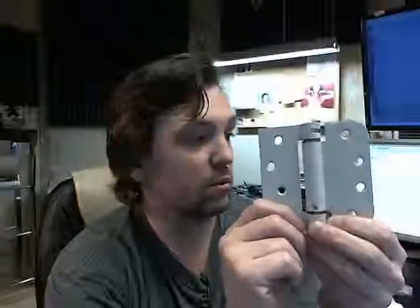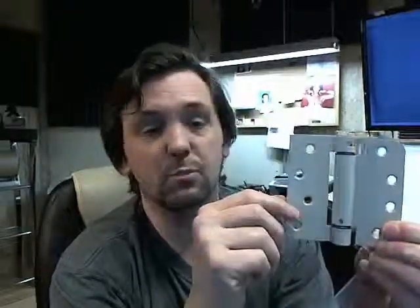For this hinge, for up to an 85-pound door you would use two of these spring hinges and one regular butt hinge. The axis of pivoting is standard so you could use a standard butt hinge — you wouldn't need a special commercial hinge. If you have a door that is up to 110 pounds, you would look at three spring hinges. I am a fan of, if you are unsure, putting all spring hinges on there, because that will allow you to set less tension or torsion on the spring. If you have too much tension set on the spring and it breaks, these hinges are not repairable — they have to be replaced. You can buy them in any quantity; you are not required to buy them in pairs. You can buy three or one if you need.